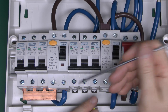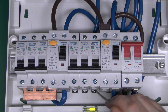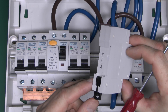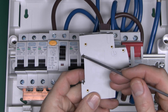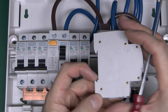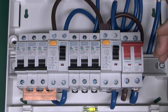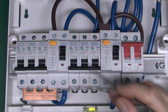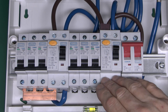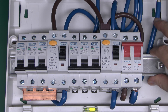If you wanted to change one of these - say it was the wrong rating or whatever - they actually just clip onto the metal bar at the back. It's a question of putting a screwdriver here to release the clip, and then it just lifts out as a complete unit. At the top here it just hooks over the top of the bar, and then the bottom is just secured by the clip which hooks around the base. If the clip is pressed in, you can generally just hook the top on and then snap the base over like that - and that's reasonably well secured. It's the same deal with the other devices as well, the RCD and the main switch - they just clip over the top and bottom of the bar at the back.